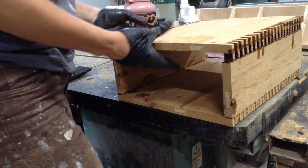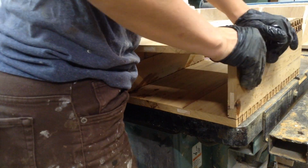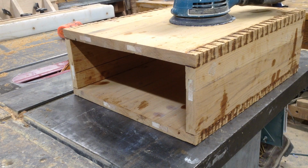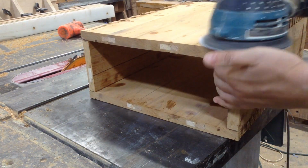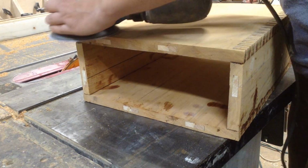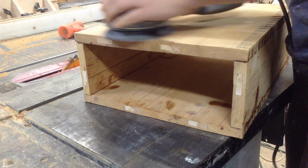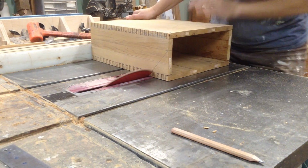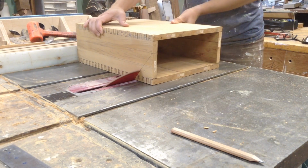I consider it to be a pretty easy build for a beginner. I've been using it for probably about a year now on multiple projects. It's still aligned and cuts really well. If you don't want to make a jig, you can buy finger joint jigs for the table saw. They also make them for the router. It's a really solid joint to use.